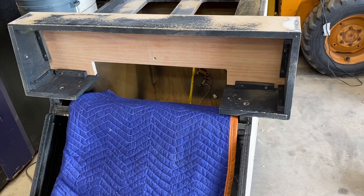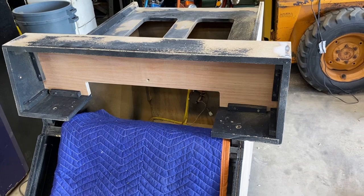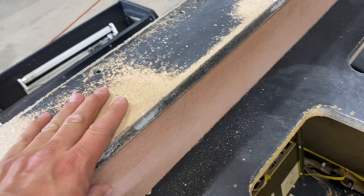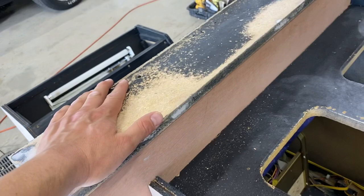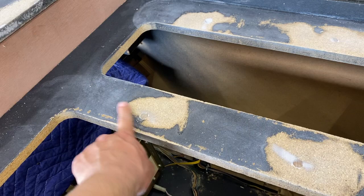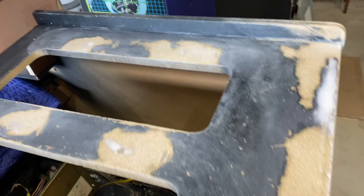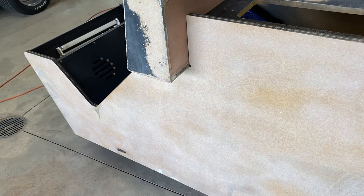It's ready for paint. I'm going to give everything a recoat in satin black finish — it's not going to show marks as much as a gloss, but it's also going to hide more than a flat wood finish. I got the hardware removed and I'm going to paint the inside first, then the outside including the bottom. I ended up sanding everything down with my orbital and putting filler around the edges and the cracks just to make it nice and smooth, so hopefully they're not as noticeable once it's painted.